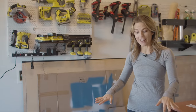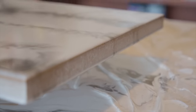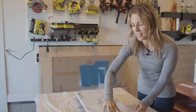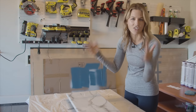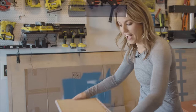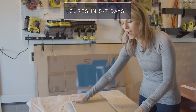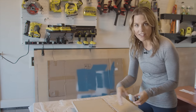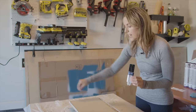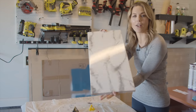I'm back after letting this dry overnight. Lesson number one: I should have primed the sides with some type of white paint — not for bonding, but the epoxy runs off the sides more than it pools on top, so I have a lot of that brown MDF coming through. It's a good idea to paint and seal a color around the edges that matches your finished project. This is dry to the touch but won't cure completely for five to seven days — once that happens I can flip it over and sand these drips off. Once everything is cured I'll use four-minute epoxy to attach the top to the dresser, but today I just want to see what it looks like so let's go ahead and add it.